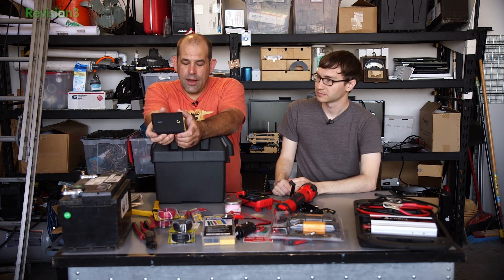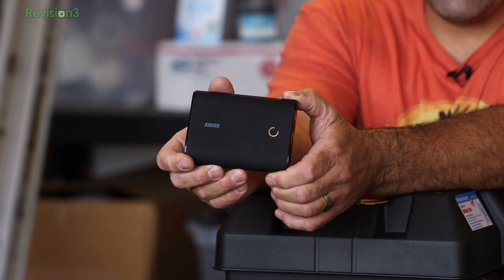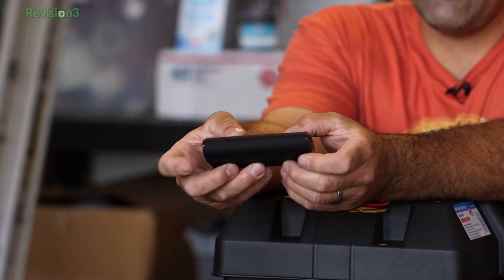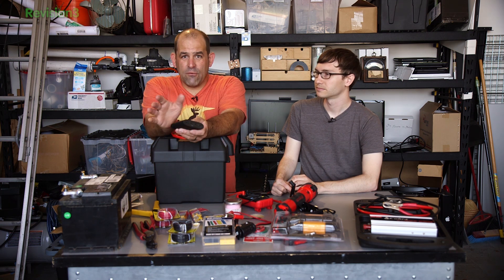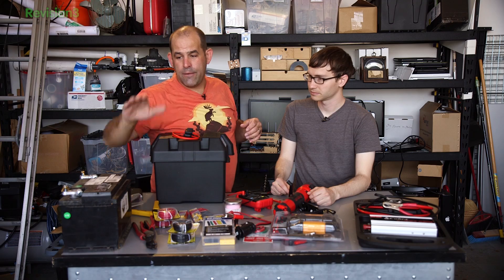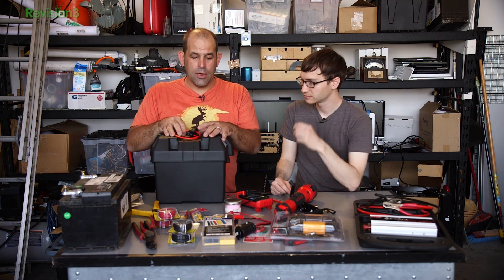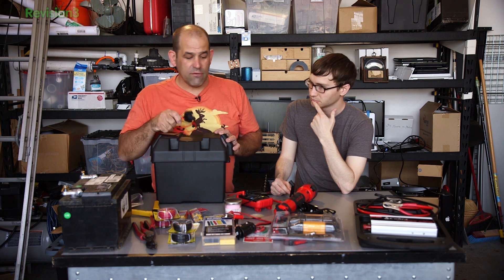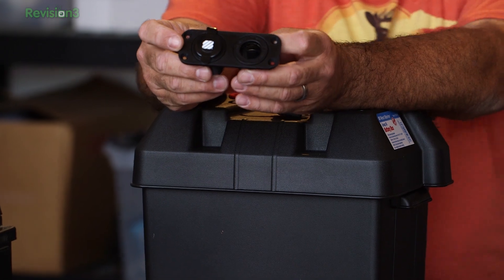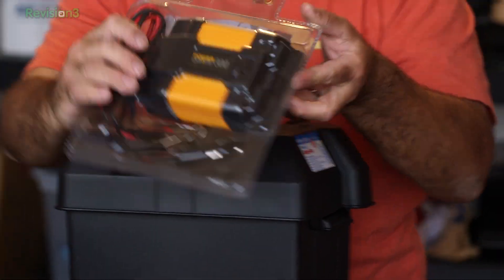Basically what we're going to create is a big battery. This is one of Anker's 12,000 mAh batteries — there's one in my bag at all times. I can charge up to three devices simultaneously, delivering a max of two amps, which is great for a day or two of travel. What we're going to do is take a full-size Group 24 or Group 27 battery, put it in an enclosure, fuse it so we don't light ourselves on fire, add some standard 12-volt power sockets, and possibly attach an inverter on top.